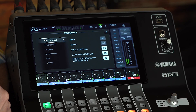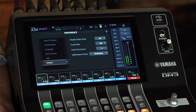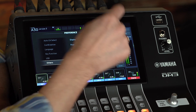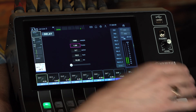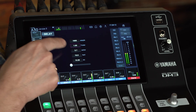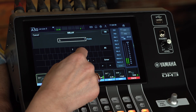In the Preference menu, find the Others list and take a look at the Frame Rate options. 60 frames per second is now available, useful for synchronizing audio with 4K60 video content. After selecting that, set the Display Delay Scale to Frame, and return to the Home screen. Look at a channel's Delay settings, and you will see that 1 frame at 60 fps is equivalent to 16.6 ms or 1600 samples at 96 kHz sample rate. Remember you can push the Touch and Turn knob to make a fine adjustment, or tap the parameter on the screen again to directly enter a specific value.